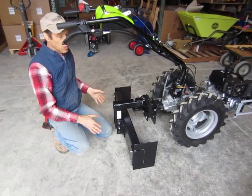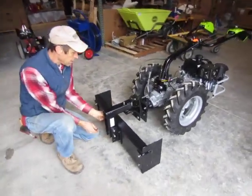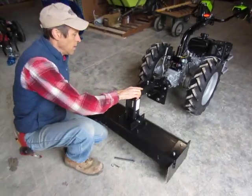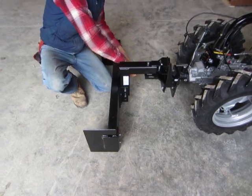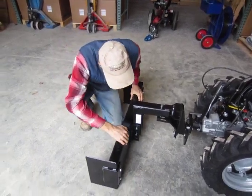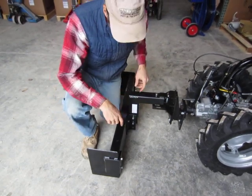If you want to convert it to a push blade, you turn the tractor handlebars around, then pull the cotter pin on the upper pin — boom, now you have a push blade. The holes are symmetrical so you can flip the blade over; if one edge gets worn too badly you can use the other side. You'll notice I'm in the upper of the three holes, which is how it was mounted on the other side — this is your pivot, and the other locks it in the dozer or scraper position depending on which way it's flipped.